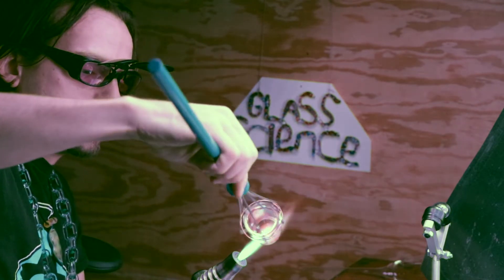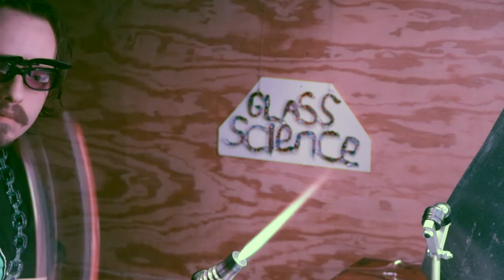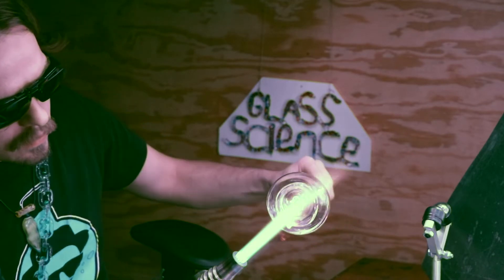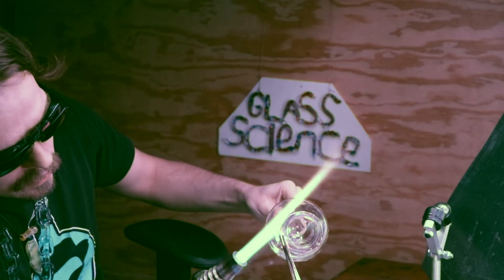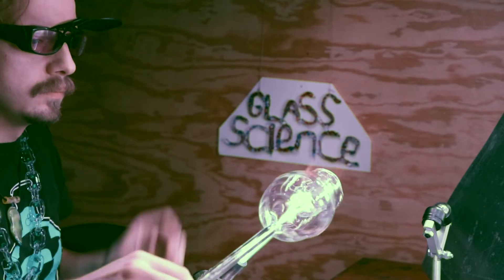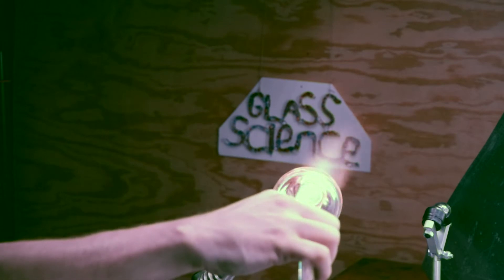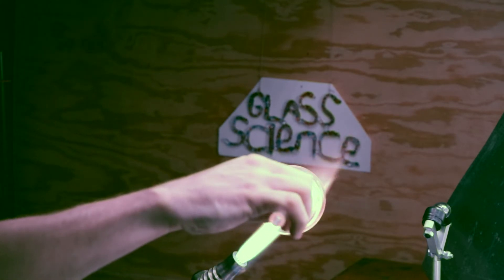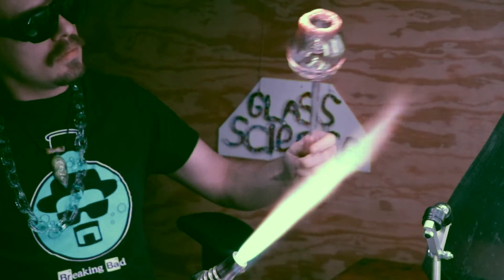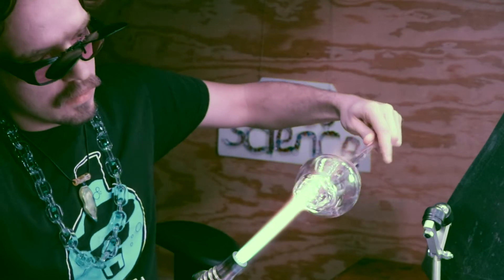Right here I'm just heating up the end and flicking it to round it out and pull it out a little bit — it's a bit like blowing into the vessel. Now I went ahead and placed that smaller tube inside the larger one, and the lip on it is holding it up from falling inside. I'm just going to heat up a small area to hold it in place, and then go in with a very hot flame and melt that entire lip in. One thing I find that helps when learning is trying to find something relative to what I'm learning and learning that too — it leads you down a path of more connected knowledge.